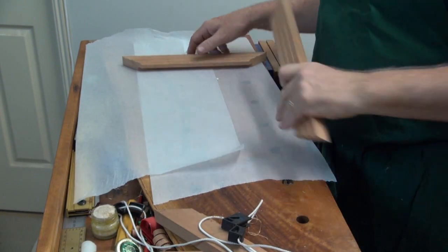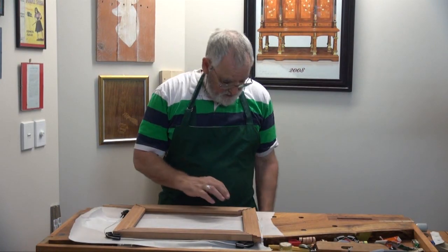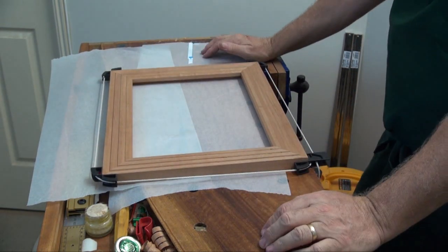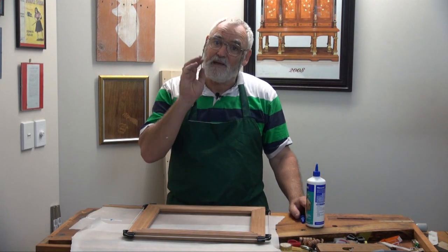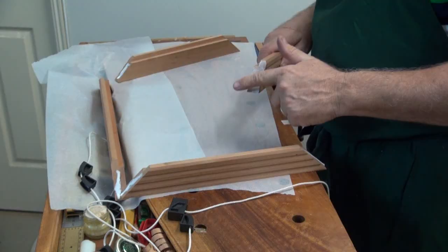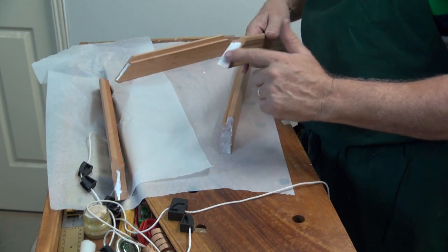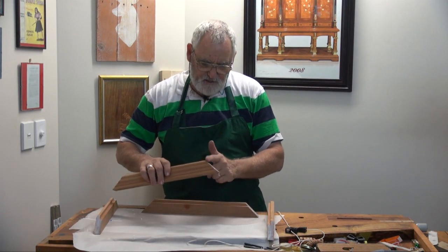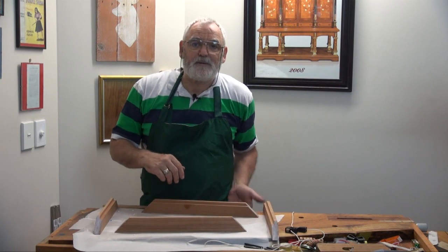Dry glue up to start with. And if you could smell the roast lamb I'm smelling at the moment — I'm looking forward to tea tonight. And that's looking pretty all right. Now what I'll do is just glue it up. I like what they call double gluing, which means you put glue on both surfaces. End grain is notorious for sucking up glue, so generally you've got to have a fair amount on there. And there's glue that splashed on the paper — that's the exact reason that paper's there. It saves my bench from getting glue on it.